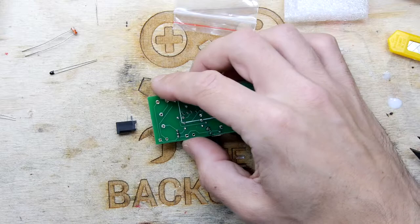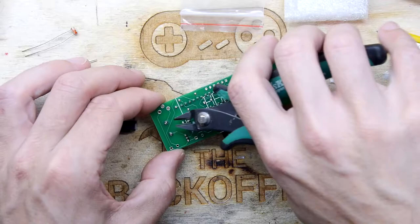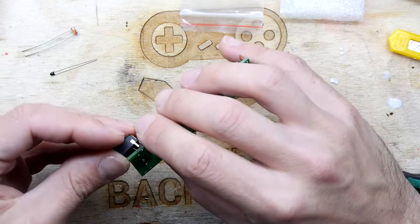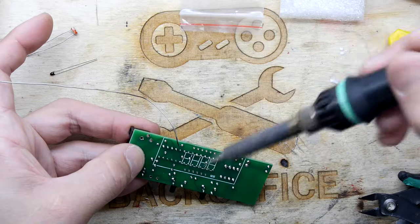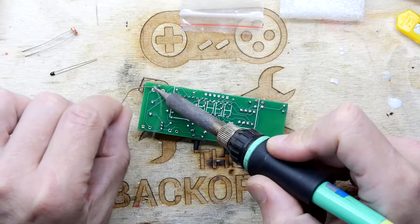We didn't use any additional flux at all. The PCB board was clean. The components were lovely and clean. So I didn't need to use any flux there. And not only that, there's not really any components that need a massive amount of flux. It's all pretty good. There wasn't one surface mount among it. You're saying, well, do you really need flux for surface mount? Yeah, you might. Not always. Not for new stuff. Handy for removing stuff, but if you've got big ICs, it can be good.